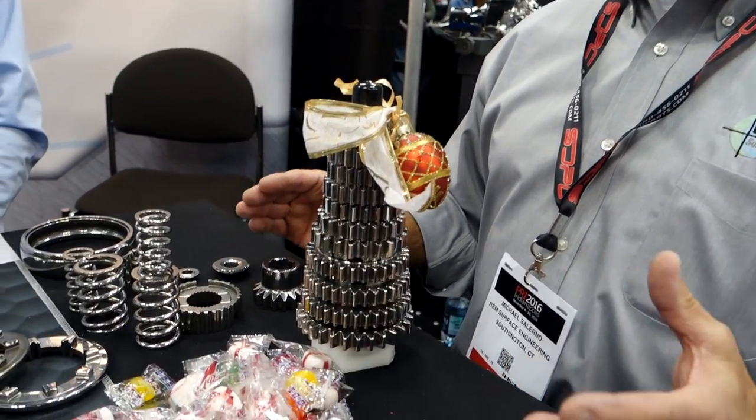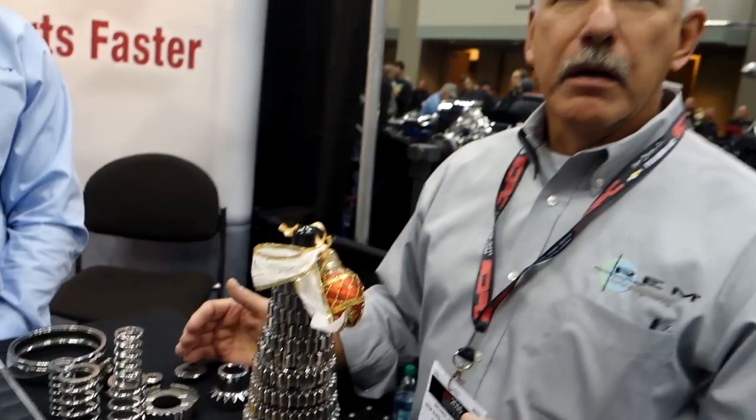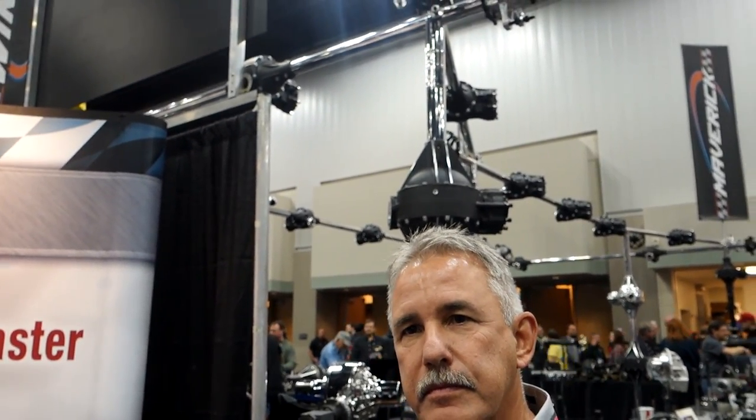And you notice that when you go to set up your rear ends, you'll see that your setup pattern's off, or you have too much play in your pinion shafts, depending on what types of materials people are working with. Sometimes you look at some gears that are done and you can still see the machine marks in the gears, which is okay. And others are completely obliterated and so smooth that I wonder if they take too much off.